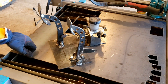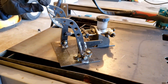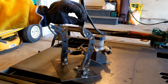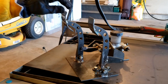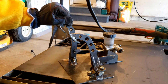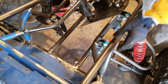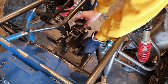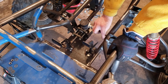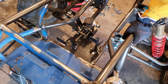We've got the pedal assembly welded up. Here's the throttle pedal — this is where the cable will hook up. We put two tabs on here with lock nuts on the bottom that can control the amount of throw: forward throw and full deflection throw. Once we get the throttle set, we'll use those to stop it. On the brake pedal plate, we just mounted the master cylinder, and that'll be our brake with the push rod. The pedal assembly sits in the frame right here, fitting down in and butting up tight against the plate, with the throttle cable mounting in here.